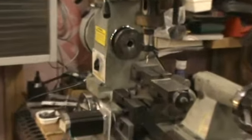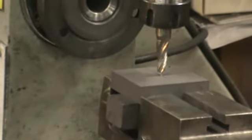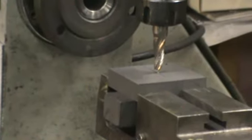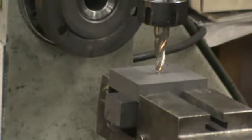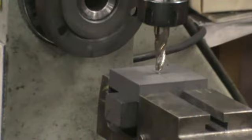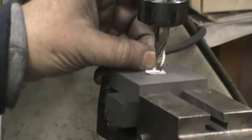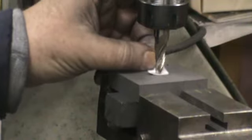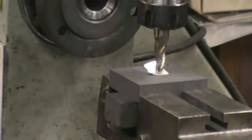I mean, I'm not a machinist. I don't know. There's probably a lot of easier ways to do this, but with having the jog set so slow, I can jog right down reasonably close to that. So I just take my keyboard, I set it over here, and I just take a double thick piece of paper. Okay, it just pinched it, there's no sense going any further. So I'm gonna set the zero point on the Z axis just like I did the X and the Y. So now it's sitting at plus 000.